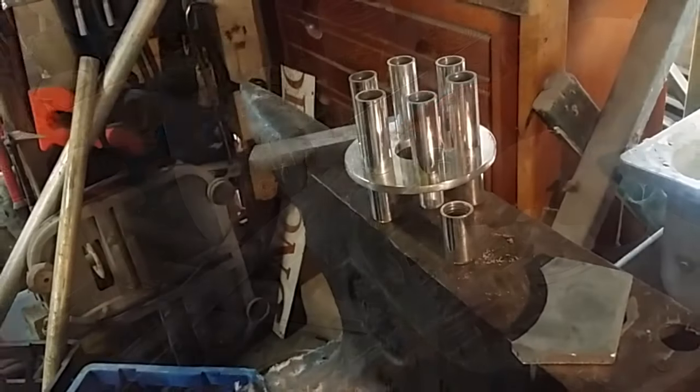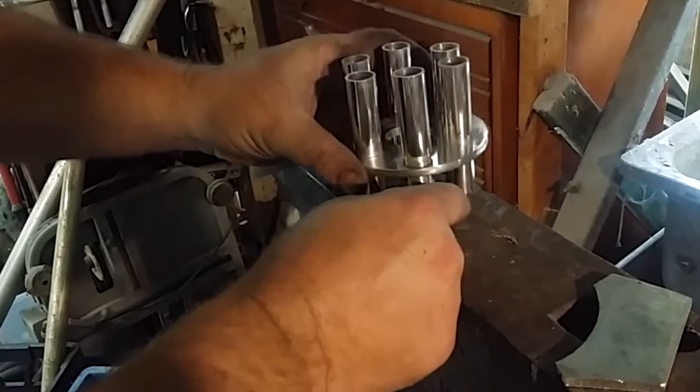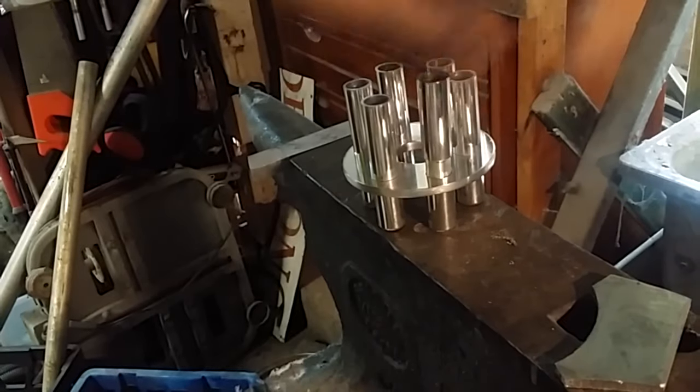Before I hammered these pieces together, the inner tube was slightly tapered at the end to make sure that the alignment would be right, and the tube was sanded overall to make sure that the friction fit became tighter the more it was hammered on.